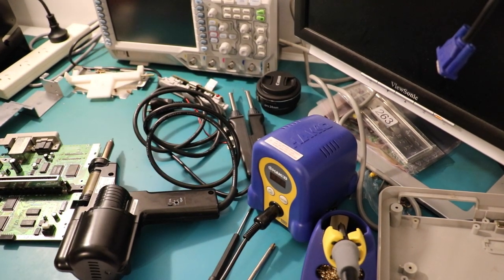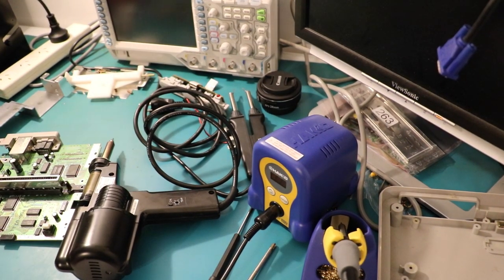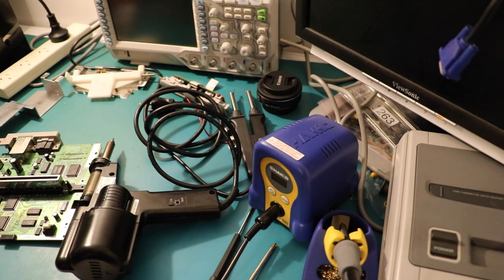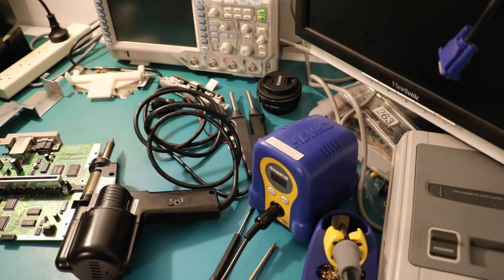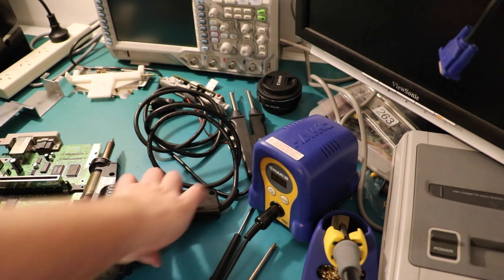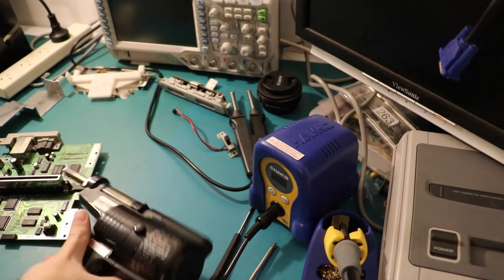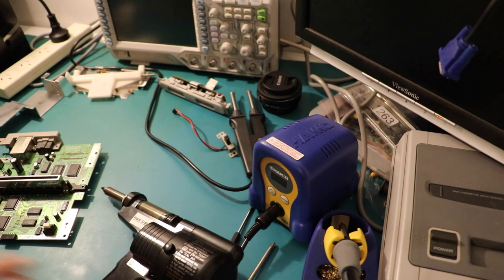Get this SNES shell out of here. Where am I going to put it? With the rest of it. There we go. Problem solved. Everything out of the way. And hook the 808 in. Gosh, no wonder my videos are getting so long. It's because I just ramble on about nothing.